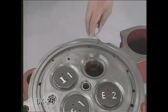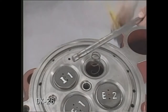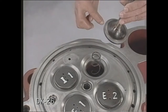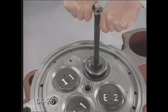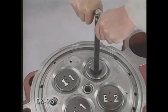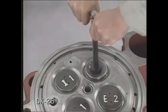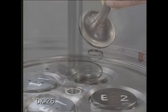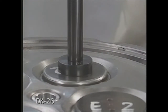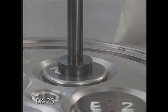Conduct the facing up of the intake and exhaust valves. Apply oil to the valve stem. Use various grades of carborundum in the order of coarse grade to fine grade. When using a coarse grade, grind the valves by tapping. Use the finer grade for finishing work — grind the valves by turning. Conduct the oil facing up. Finally, check the points of contact with bearing blue.